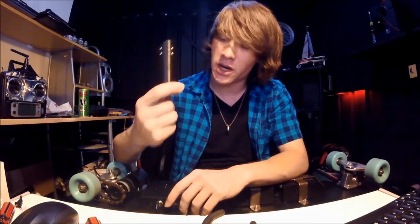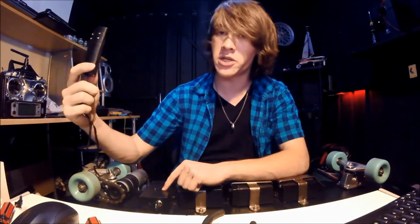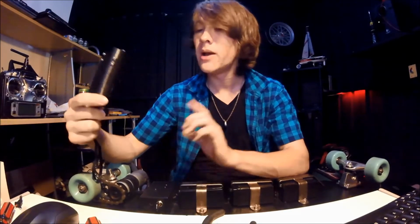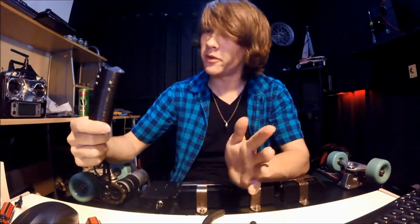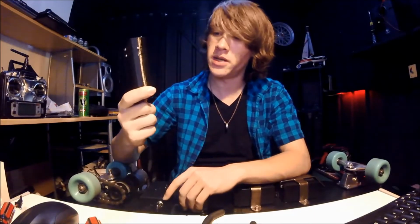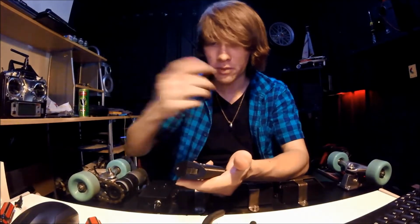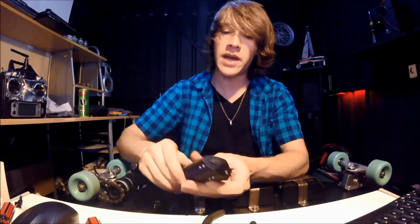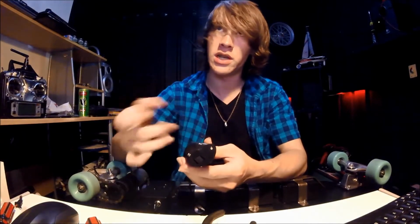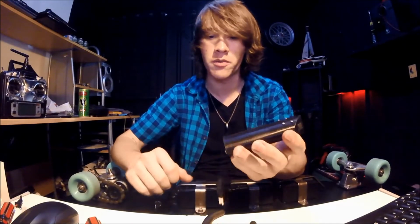Now this is underpowered, and so is this, but they seem to be running fine. The receiver is supposed to be running 7.2 volt, 7.4 lithium polymer. It's currently running 6, seems to be fine. This is supposed to be running 6 volt, and it's running off 5 volt, and that's actually running a 3.7 volt 1-cell LiPo battery. I believe it's 240 milliamp hour, tiny little thing, and that's going through a 3.7 to 5 volt step-up micro transformer that I pulled from a power bank.